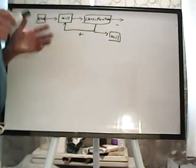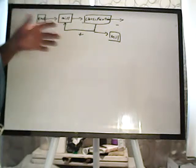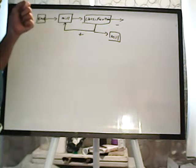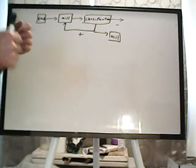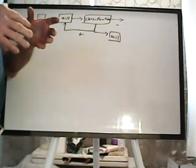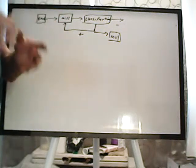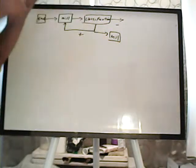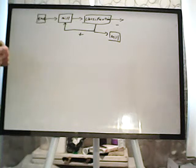It can also depend if you have secondary. If you have an ore that has a lot of different minerals and one's a lot tougher than the other one, the first pass at it will tend to grind up the softer material, and then you really want to change things up a bit to go after the harder stuff. Then you can go to a separate secondary system. Yeah, there's lots of different ways of doing it.